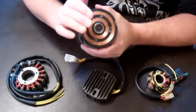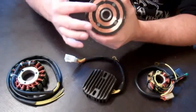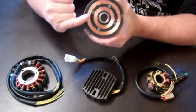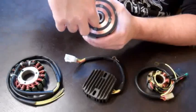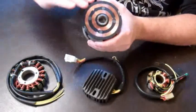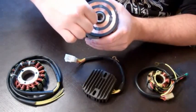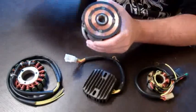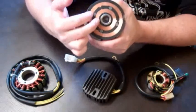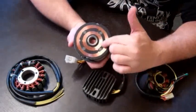We have very highly machined rotor faces. The run out is to a minimum, better than the stock parts were, which gives you long brush life. Because the flatter this surface is, the longer your brushes are going to last as they ride on the slip rings here. If there are no ridges or uneven surfaces, the rotor has a real smooth surface to ride on and you don't get any unnecessary wear. We use really high quality slip rings — the copper is of the highest quality, and that means long life for your brushes and for the rotor face.